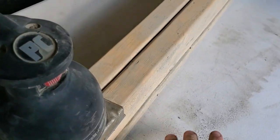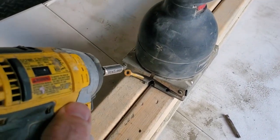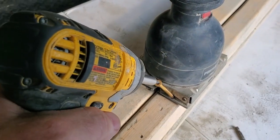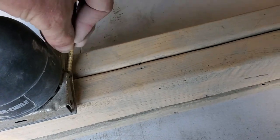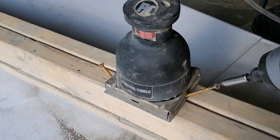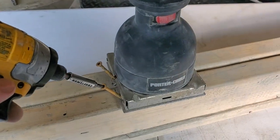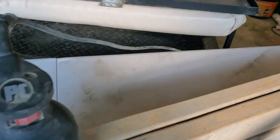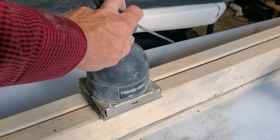I use the same three-inch deck screws that I assembled the whole thing with and screwed them in through the holes. Get them all three started first because of the existing holes. Once you screw this down, it will vibrate when you turn it on — just enough to cause the whole apparatus to float across the top of the concrete mix.